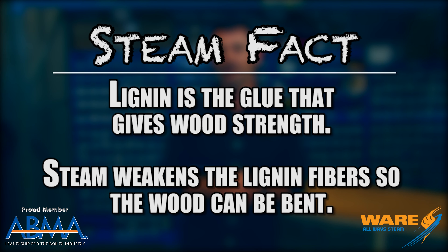Basically you hook up something that makes steam, you seal it, you make a little place for some of the steam to release so you don't build pressure, and you put the wood in there for whatever time you need. You can also use a plastic bag.